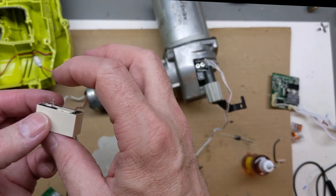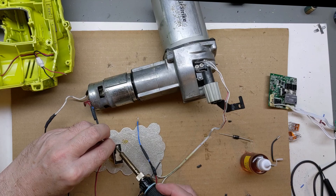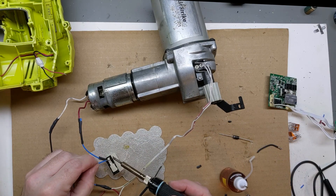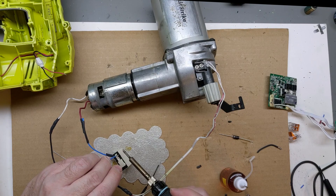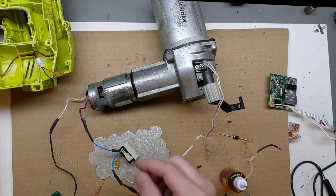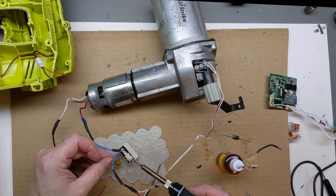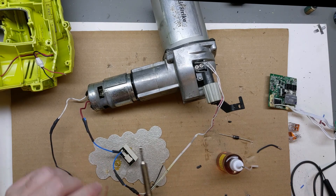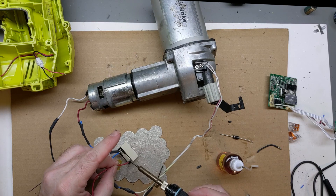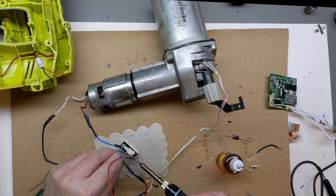As a test, I'm going to use this small relay that'll fit easily into this spot - one about twice this size, the depth will probably be fine. I've already tinned my wires, so I'm going to solder them through the relay terminals. I actually have the relay base for this relay, but I just want the smallest footprint. I've already tinned the wire and put some rosin flux on all the terminals, and pre-tinned those as well as the wires, with heat shrink sleeve on. This relay does not care about coil polarity.